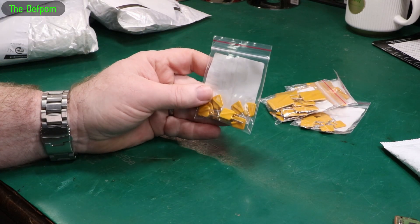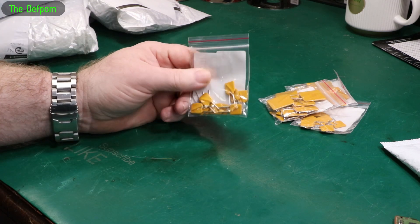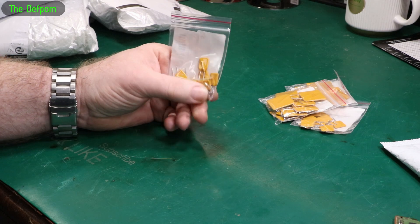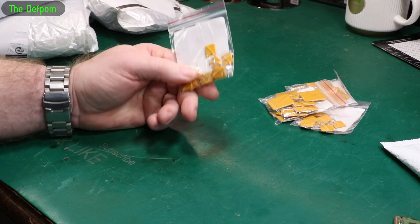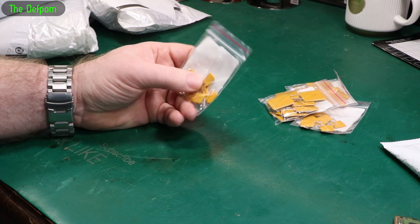I needed to fuse the Raspberry Pi devices, the touchscreen, and all the control system. I used PTCs because that way, if something goes wrong, it will reset itself and come right again eventually. If you've got a fuse that goes, it's a pain — you've got to pull it all apart and fix it. But if you have one of these go, you can just turn the power off, let it go down, turn it back on again, and it will come right if it's a minor overload.